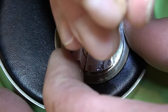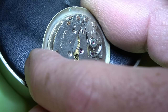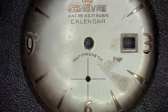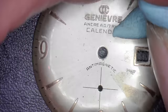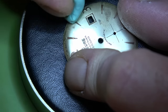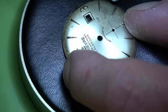The dial comes off with these two screws here. Just give them a bit of a turn until there's a flat side, make sure that's lined up with the dial feet pins, and the dial just comes away. Sometimes you may need to get a screwdriver in between just to pry it up, but do it gently. Now that the dial is out we can see it has seen better days — some of the varnish or lacquer has come off just by the date. Apart from cleaning it up with a bit of rodico, there's not a great deal we can do.